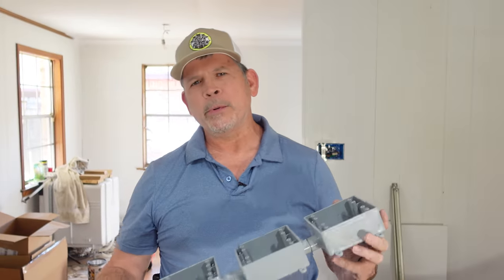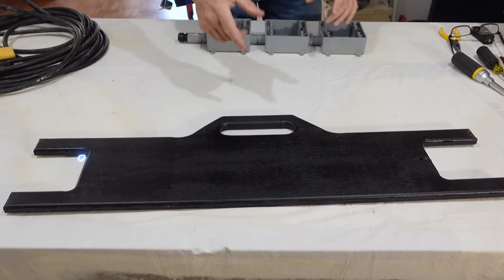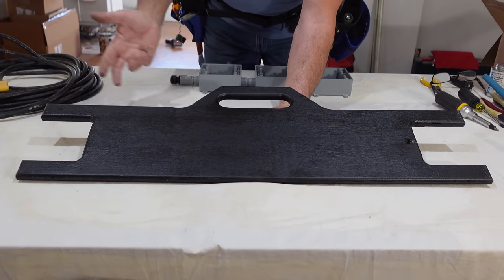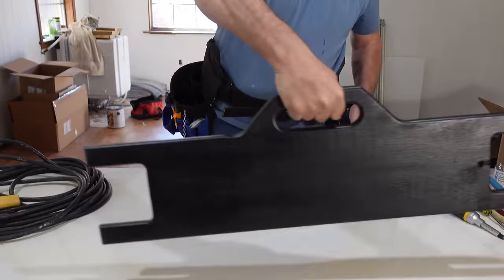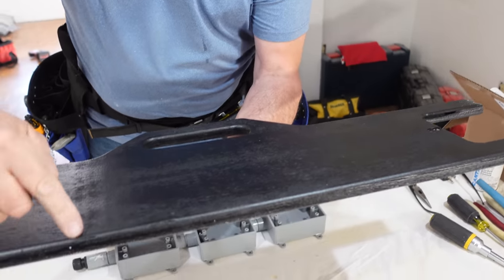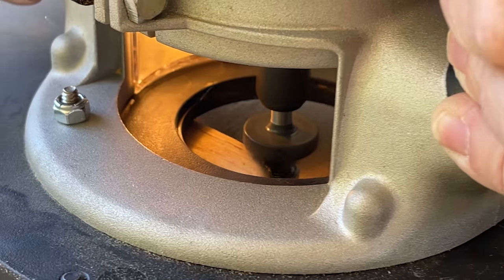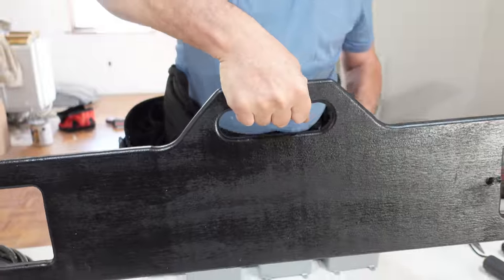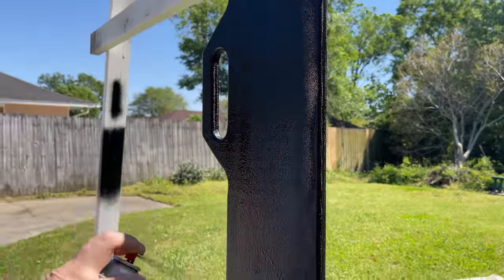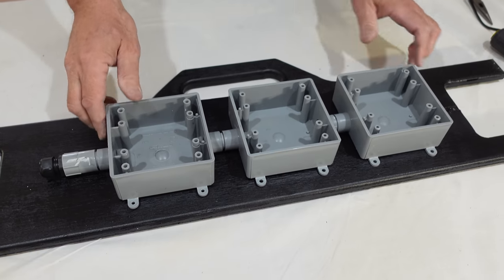If this is the backbone of our cord, this thing needs a foundation. We custom cut a piece of plywood for this to mount on. Check out all the features: we've got notches on each end to wrap the cord — I can probably put 300 feet of cable on that thing. There's a handle for easy carrying, and a hole in the top so I can mount it on a nail at a job site and get it out of the water. We used a quarter-inch roundover bit in our router on every edge, even the handle, so no splinters. The last thing: it is coated in black Flex Seal — first time I ever used the product and it worked awesome. You guys asked for rubber coating — there it is.